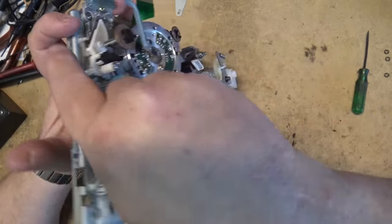Once we've got the gears in place, we take it back to the loaded position and make sure our holes here are lined up — you'll be able to see the chassis below, and that way you know the alignment is correct. Then I take the main cam gear and put it back on. As I rotate it, we'll see the alignment holes. There's another hole here we need to line up. As I look through the hole, I can see there are three pins through these holes, telling us our alignment is correct.